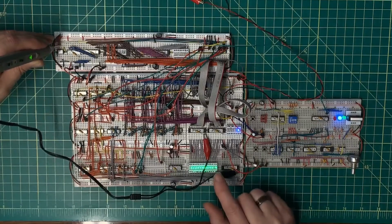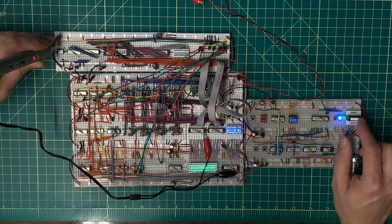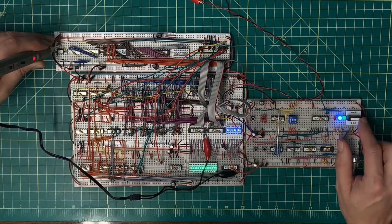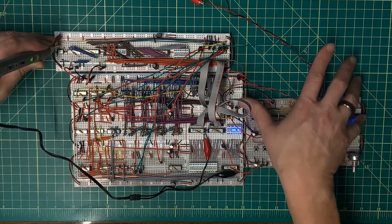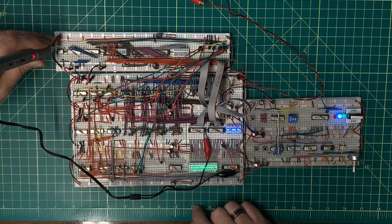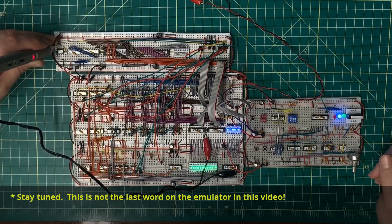So the problem is I'm getting an extra clock tick for the first byte, a 9-bit byte rather than an 8-bit byte. And then if I continue on, there were 8 more clock cycles, and the rest of them work just fine. It's just that first rising edge which is causing me a problem. All right, so why didn't I see this in the emulator?